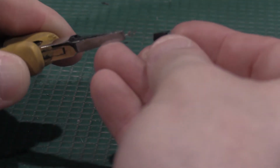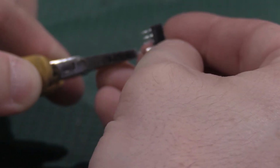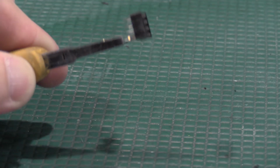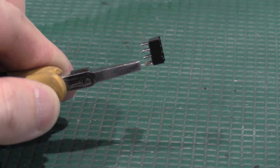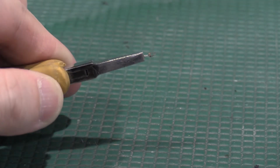Here's the socket. These would grab the socket, or the IC pins, in that direction, which does not make a good connection and is actually pretty terrible. So they're intermittent. If you see these, they are well worth replacing, especially if they're giving you trouble. It was some of my trouble. The other trouble was a bad range switch, which I will show you. Put this in the bowl of shame for the bad parts.